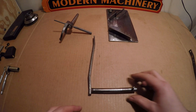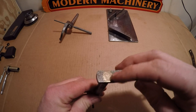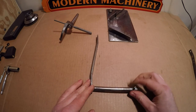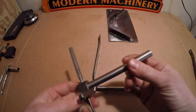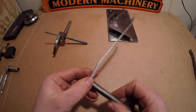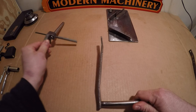The easiest way to accomplish that is just going to be replacing the shaft entirely. It looks like it'll be fairly easy to do — it appears that it's only brazed onto the lever, so I believe these two pieces will come apart without a lot of trouble. I've already got a new shaft started and have the fork end completed already. I just need to finish out the lever end, but to do that I'm going to have to get the lever off the old shaft to figure out what end profile is on here so I can replicate it with the new one.